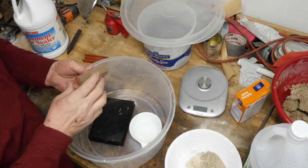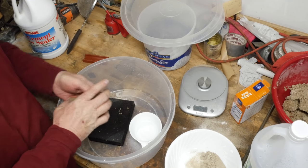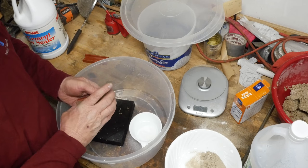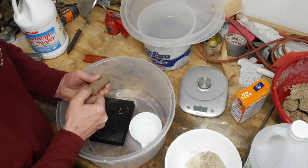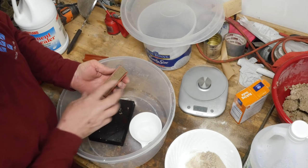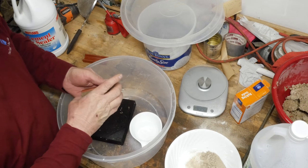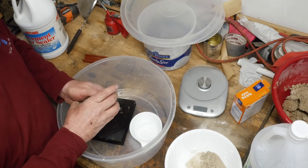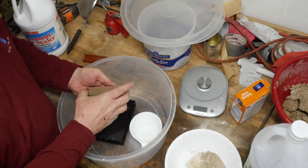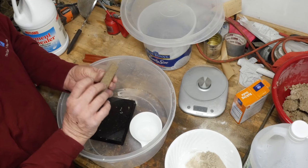Let's see what we've got now. The nice thing is it's good and hard. The question is always: can I get this thing out of here without breaking it? A little concerned about that spot — it could be a weak spot. I'm going to clean it off here just to make sure I don't have any edges sticking. Because it gets wider as I go in this direction, I'm just going to try to slide it that way, and if I slide it just a little bit the whole thing should release — in theory, if I can slide it. And there's a core! Pretty nice core. That would make a really nice hole in a hammer.